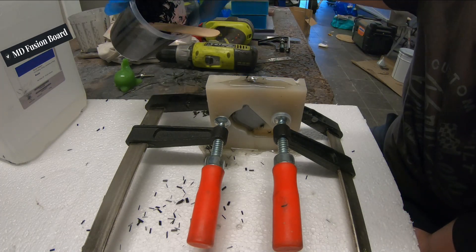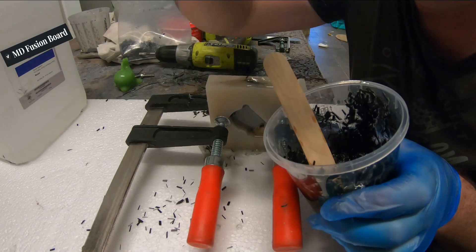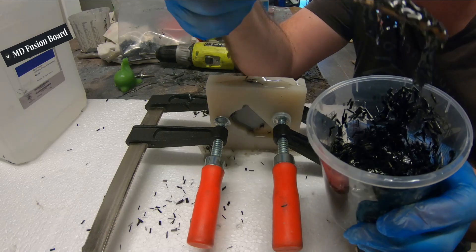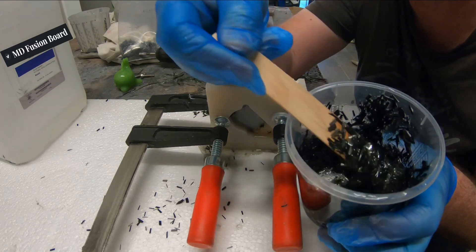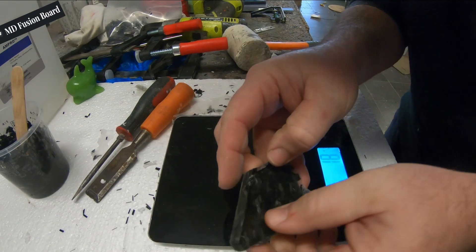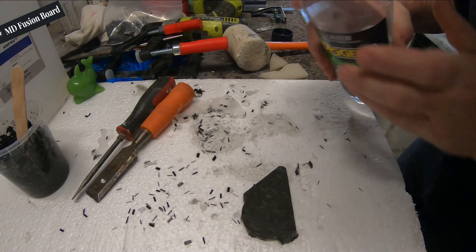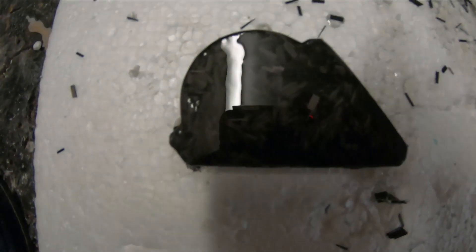Compressed carbon chop is what they call forged carbon. Some people put it into the mold dry first then wet it up, but I just find it's quick and easy when making a quick part like this to just mix it up — yes there's a bit of waste, I could probably make two molds out of that. So there's the part, I've got to clean up the edges and drill it. I'll put some methylated spirits on here to simulate a clear coat. Look at that — that's a forged carbon part!